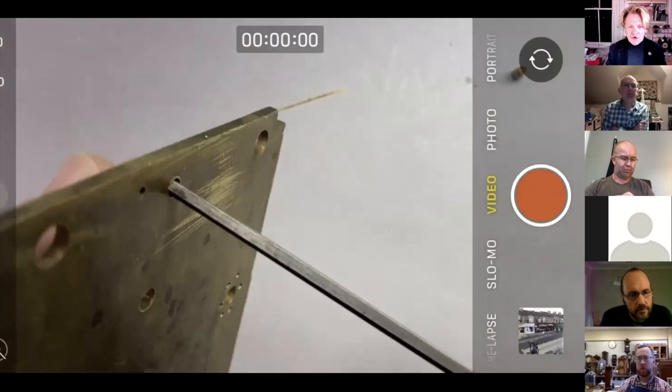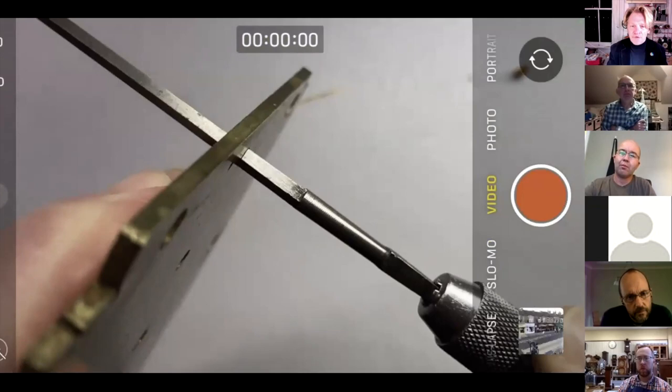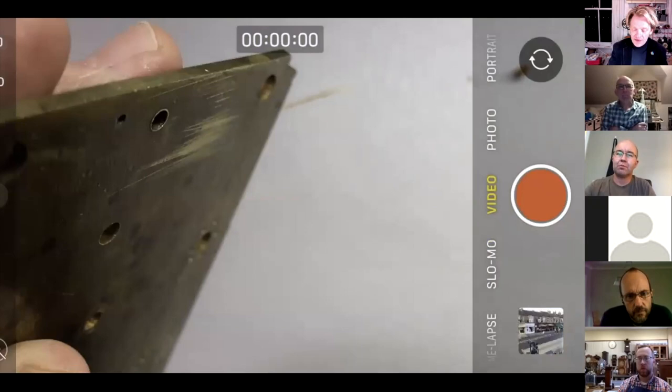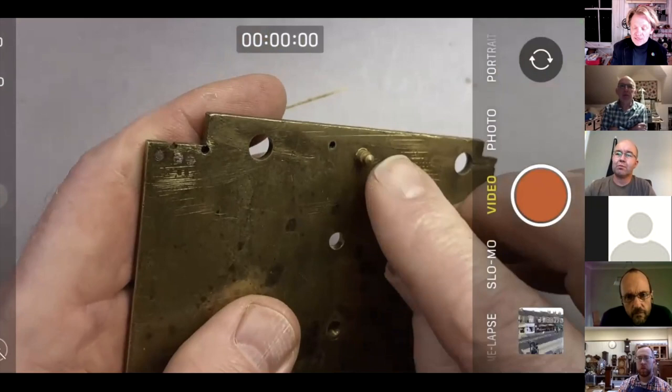And that raises, of course, five little ridges on the inside of the hole. Without turning it, you're just pushing it into the hole. What that should have done is made the hole effectively slightly tighter. So you can see it has, but we want a little bit more.